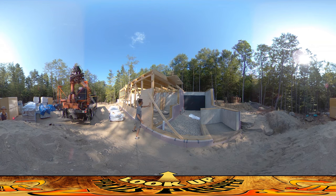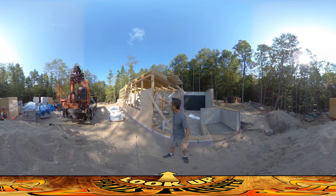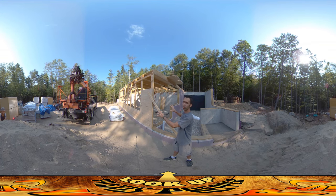Every one of these sheathing pieces — this is the actual interior wall board — every one of these has multiple nail points all on the side. So you've got nail, nail, nail — triangle, nail, nail — triangle, nail, nail — triangle, just triangles all over the thing. This whole wall is going to get sheathed, and the wall on the opposite side symmetrically is going to get sheathed too. There's a lot of open area in the middle where the windows are going to go, but the whole bottom has all the sheathing. I figured I might as well put the sheathing on this wall and get it nice and rigid.